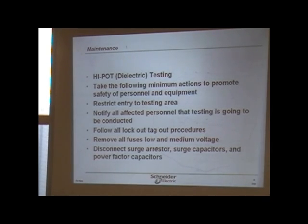You'd probably have to guess that if you don't know, but you could use your prints, and your prints would tell you that you have so many cables of such a length and so forth. They go from here to the transformer that's feeding the primary of that breaker, and then there's the secondary as well. What's the clearing device? Is it cable or is it bus run? Is it open air? It asks all kinds of questions that you take into consideration, and then it'll come up with a number or the calculation as far as the calories.